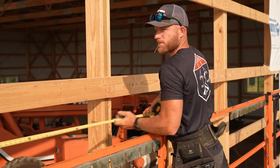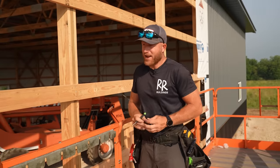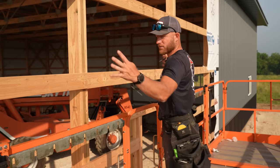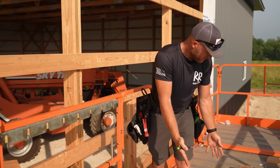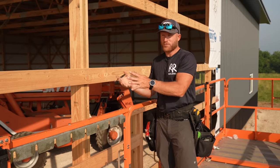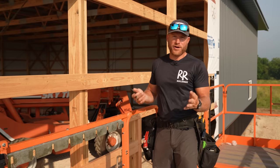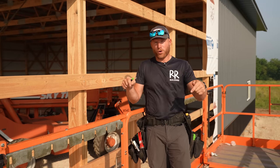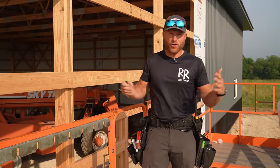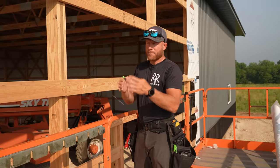Ten and seven sixteenths. Because I don't have Greg today — he left me — I'm gonna have to do all this framing myself, which is some larger length big lumber. I've got to frame the porch in because if I don't do the framing now, we're gonna cover this with house wrap and I won't be able to access the framing. I also need to dig porch holes for the concrete piers for the porch, and once I do that it's hard to get my mega deck through this wall.